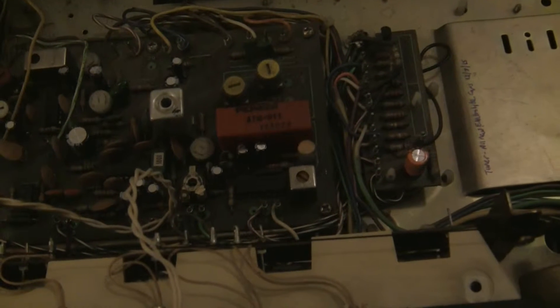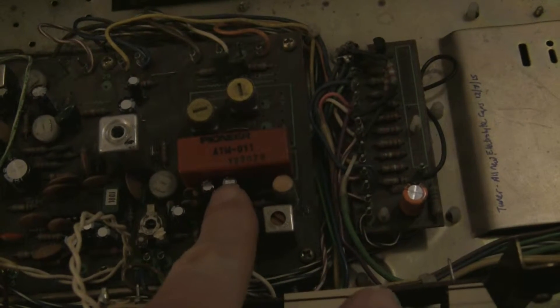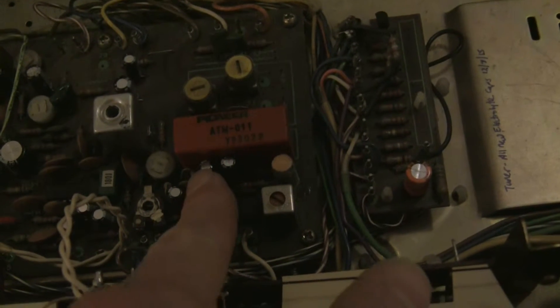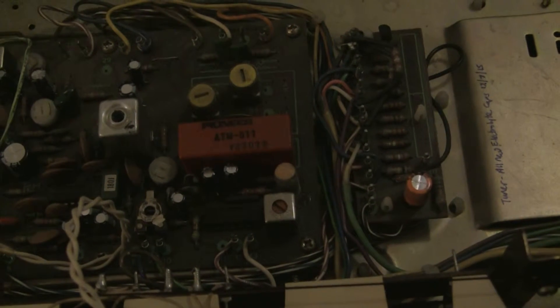This one will still get recapped. The tuner did have an issue — I've already recapped the tuner. One of the 0.47 µF electrolytics was open. These are Nichicon KL series 105°C 10% tolerance, which you can get from Mouser — low leakage current caps. Because one was open, one channel was almost dead; you could just hear treble from it. It still has some work to go, which is why I have the front off of it. It was in pretty rough cosmetic shape, so I had to take all the switches off and clean them.